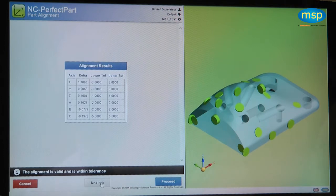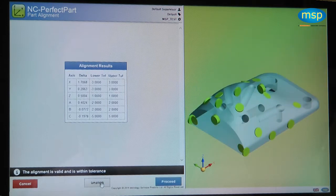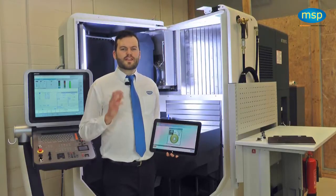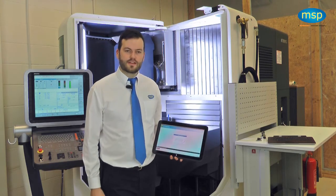This report shows the position of the part and the projected correction by NC Perfect Parts. The green screen shows that the misalignment can be corrected. It is possible for the condition of supply to be too poor or the misalignment to be too great to be corrected — in this case we would see a red screen. NC Perfect Parts gives you the power to stop you making a bad part as well as enabling you in making a perfect part. It is a green to go, red no-go system. The calculated alignment is automatically uploaded to the controller by simply clicking this button.